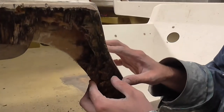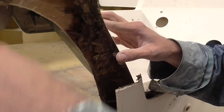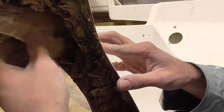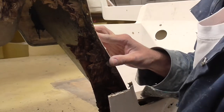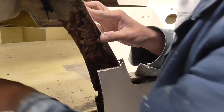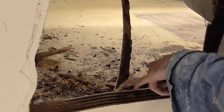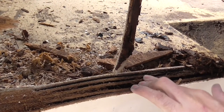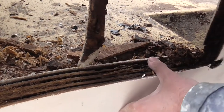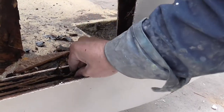As you can see here, we've cut the small section out. You can see that was the rotted section we were pushing through before. You can see where it's delaminated — it had no strength in it. And if you look down a bit further here, you can see the layers in the wood where the water's actually attacked the glue and separated the ply. You can see that through there as well. The water is obviously sitting down here and you can actually pull it out with your bare hands.